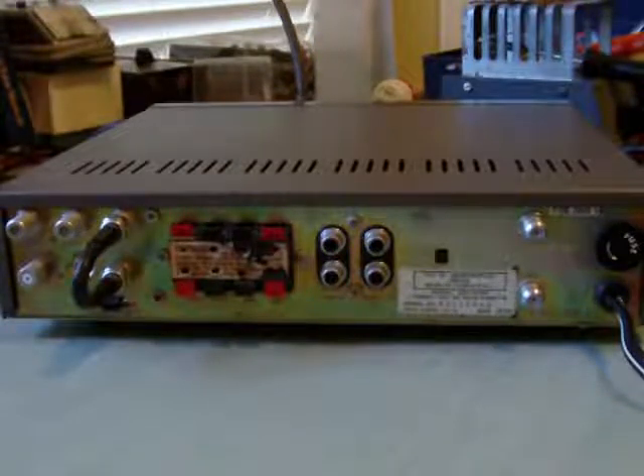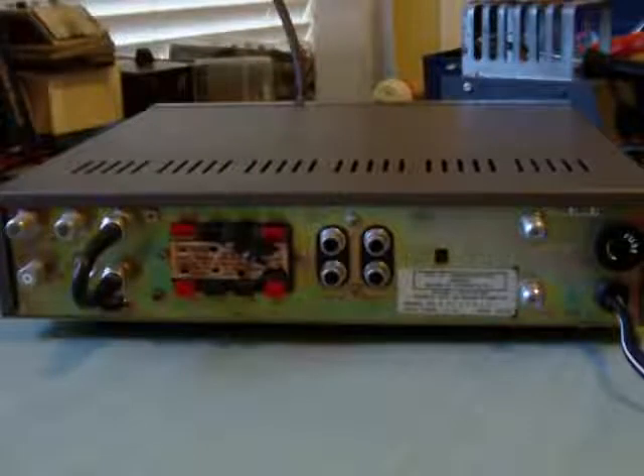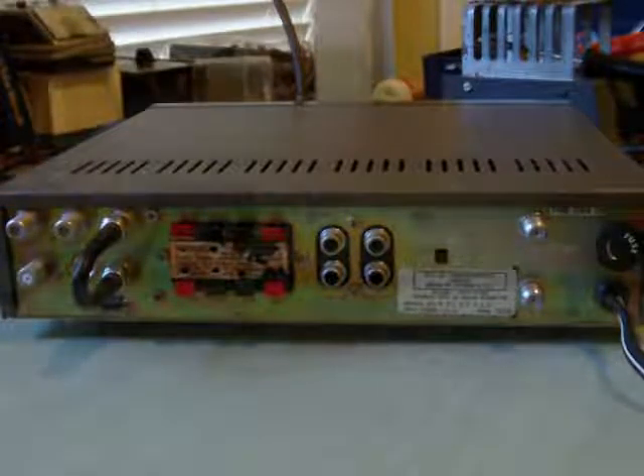The 6000 has added in the back an RF outlet and two-channel audio, but is basically the same. There's also a switch that determines whether you've got the one-gigahertz input coming directly from an LNB, or coming through a combiner system where you're receiving from two different feeds — in case you have multiple satellite boxes feeding from a single antenna or multiple antennas.